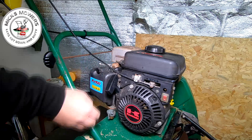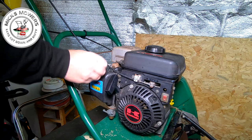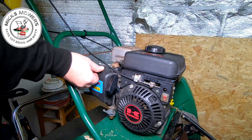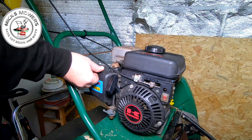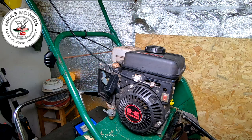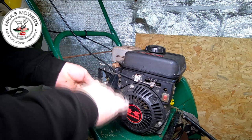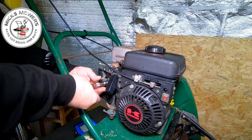That's how you service a machine, but we need to go further and take the carburettor off. First, turn the fuel off — off is over there. Turn the fuel off, then remove the air filter. A note from last time: I couldn't get the float pin out and actually damaged the carburettor, so go careful. Air filter off, air box off — you've got a couple of 10mm bolts in there. Grab a 10mm bar and socket and undo these retaining bolts.